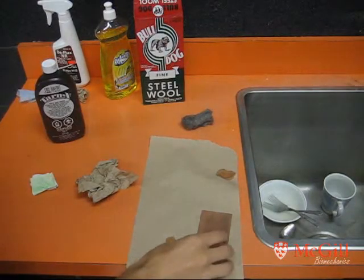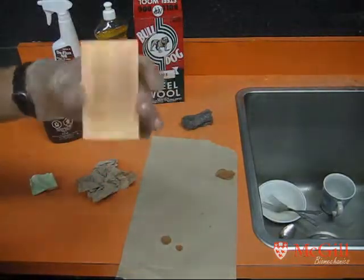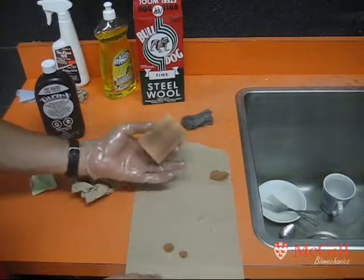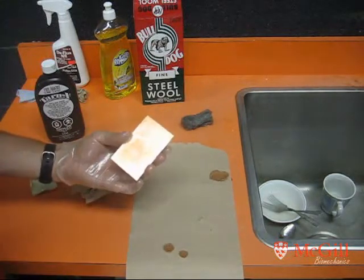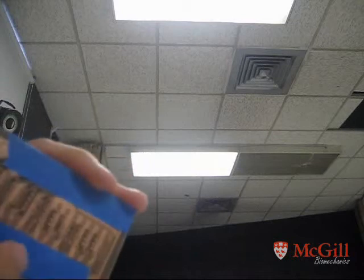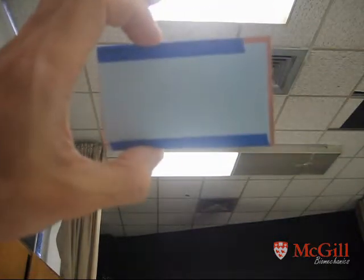All that drilling likely caused some dirt, and the heat from the laminator caused a little bit of oxidation on the copper as well. So it's a good idea to clean our back surface again before we do the registration and lamination with the toner image. Now I've got my pattern registered. Make sure when you put your piece of paper on you have the toner side down because it's going to go on the copper, make sure it's oriented the right way, and look to make sure your pins here align with your pins on the other side. Using the light, you look through the little hole and you can see the light shines through both the paper and the copper — I did that for all four. Make sure they're lined up as perfectly as possible and then tape them in place. Double check again after you tape because it could shift a little bit.